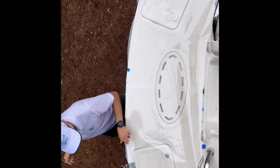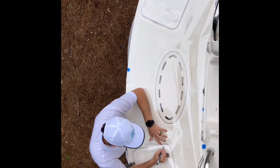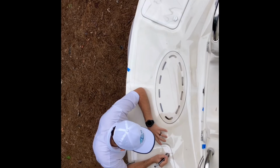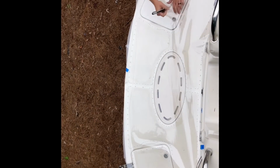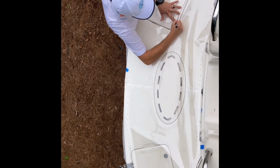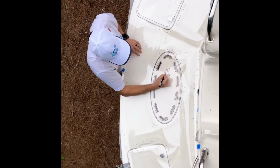With a permanent marker, trace the non-skid on the mylar. You can do dotted or straight lines. Identify corners, latches, hatches, grill mounts, and related objects by tracing its location. If you make an error while tracing, simply mark it with an X or erase with alcohol and continue. You can also make notes about your template.